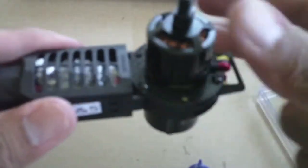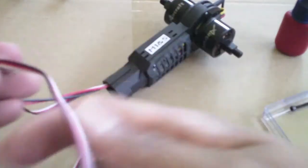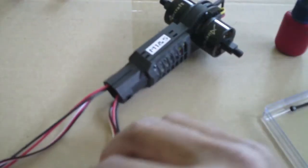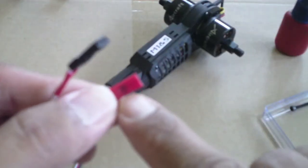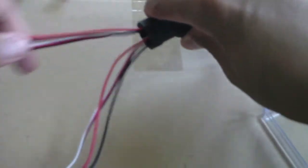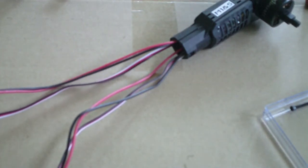These are labeled M1 and M5, so you'll do this three more times. Another important thing: make sure you won't be confused later on about which one is which. Label the wires — for example, this one is motor number one and power source number one. Label them number five as well. Get a small pen and mark them, or use tape to mark the ends.